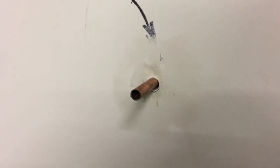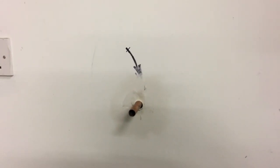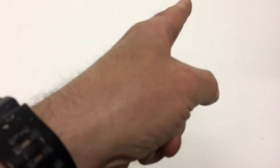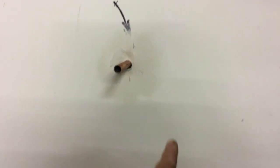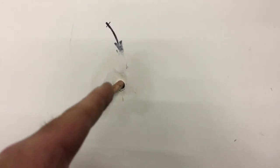Here's us at the other side of the wall now — this would typically be under your kitchen sink if you're installing an outside tap. One of the first things you need to determine is where you're going to take the feed from. The normal thing to do is trace the cold water pipe from your tap above your sink down — you'll probably find branches going to a washing machine or dishwasher. Just make sure it's the cold feed, use an area of the cold feed that you're going to tap into, and figure out what fittings you're going to use and what run you're going to take to link up your outside tap. This pipe needs to be cut back — leave maybe a couple of inches sticking out the wall.